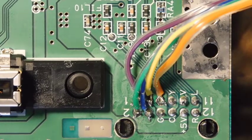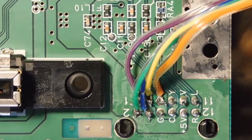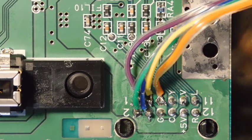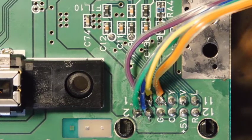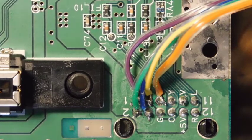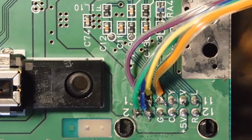The critical thing is you have to make sure nothing else is coming into that line. With this funtastic version, pin 3 is actually connected to nothing — I confirmed that with my multimeter. However, there are some older N64 motherboard versions where it is connected to some capacitors. In that case, all you have to do is isolate that pin by removing a few surface mount capacitors — I think three. But with this funtastic version, that's not necessary because pin 3 is completely isolated. So I just moved the yellow wire over from the composite video pad to the C-sync pin.